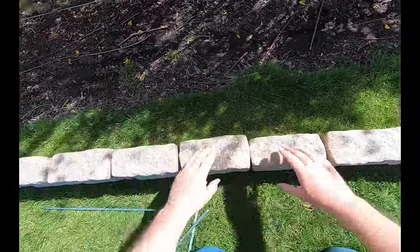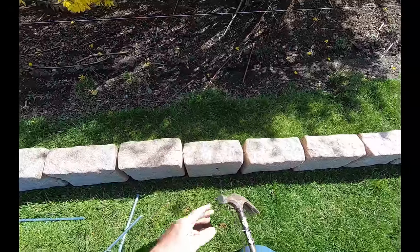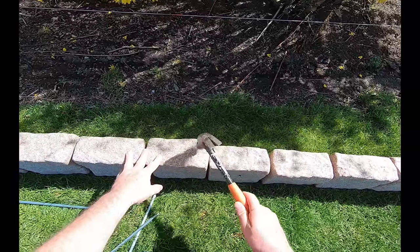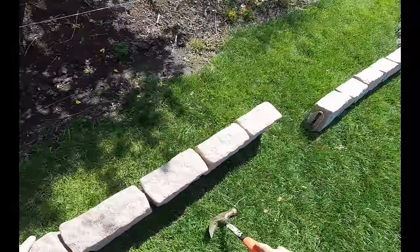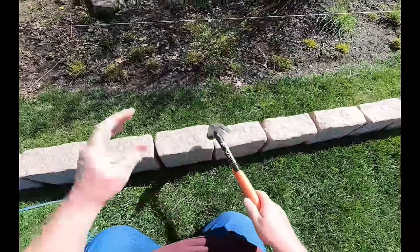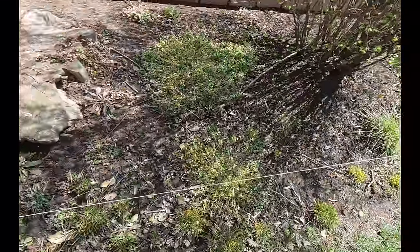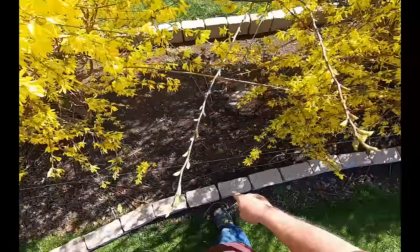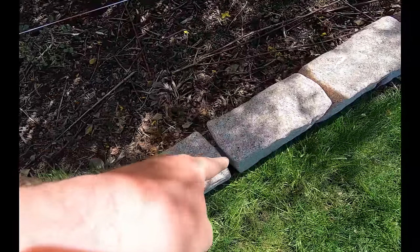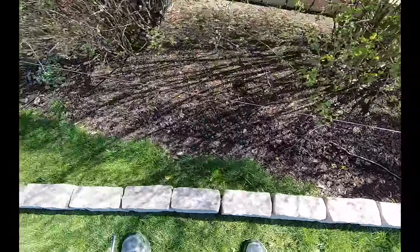When you're putting these together, give it a good whack — I'm just using a hammer. They're not breaking or anything. If you wanted to use a rubber mallet, you could use that too. But when you're putting them together, don't tap on them — just give them a good whack and they lock right down in place. You can see how flexible they are and you can make curves with these. Do you see the space in between each stone? That's how much you're able to flex these.